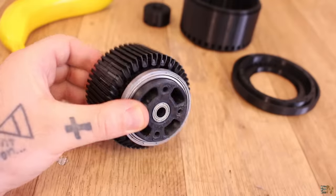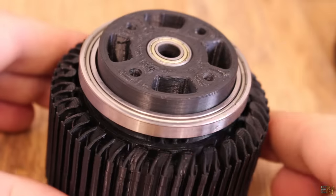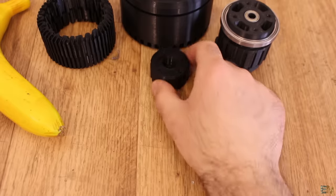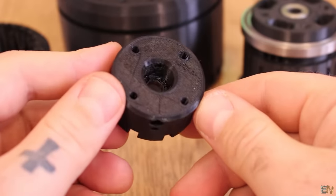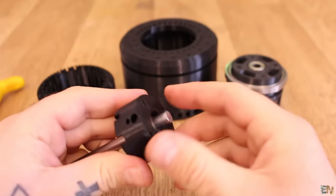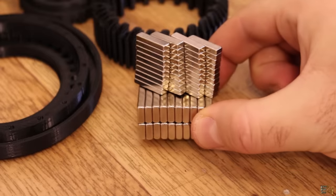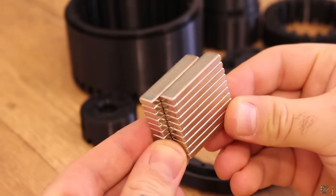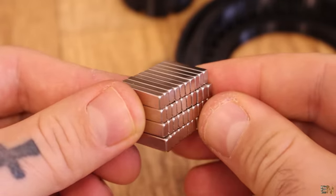On the other side we have a small bearing but also the big bearing of 62mm. In this way the motor is held in place on both sides. With a big motor like this, the back bearing is necessary otherwise it will vibrate a lot and probably not even work. The final part is the front collar, on which we could mount a propeller or anything else. This part has a space for a metal collar with a screw that will be fixed on a smooth rod. That's it for the 3D printed parts. Now next we have the magnets.